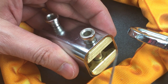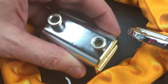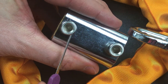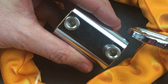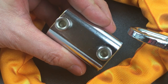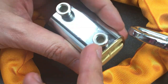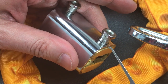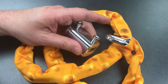It will probably be difficult to pull out, but we should be able to do it with pliers. Pushing this through brass and hardened steel is not easy, and the best way I can think of is to apply some sort of force in between these two shackles — maybe the double wrench method or a couple of long levers. I even have a low power hydraulic spreader I could probably put in between here to try. The problem with this attack is that Vero appears to have thought about it — they purposely weaken the portion of the shackle that's outside the lock body by drilling it out. So we don't have a lot of strength in the shackle up here, but I think we should have a little more strength than this thin piece of hardened steel and the brass down here. That's my idea — I'm curious if you guys have something better.